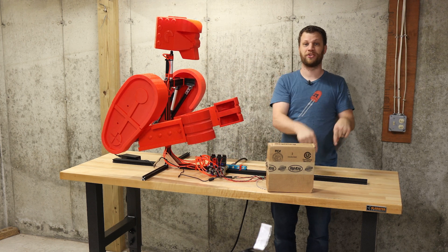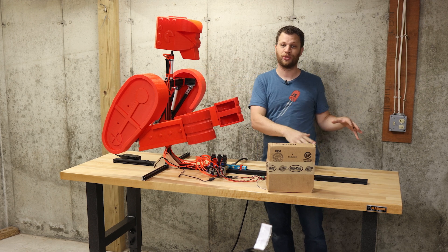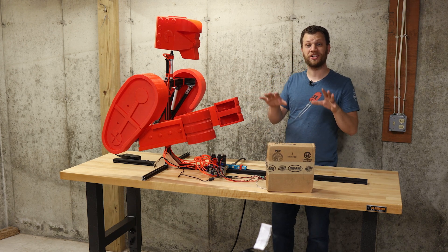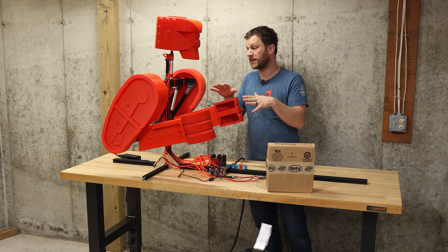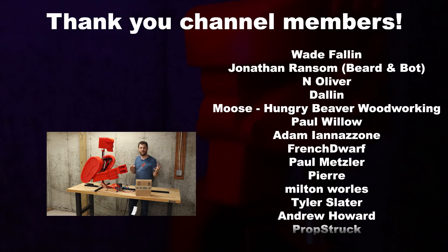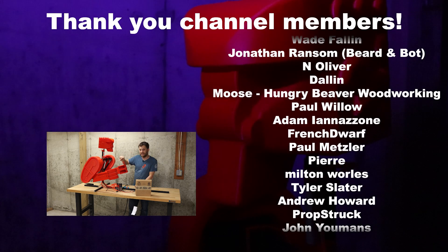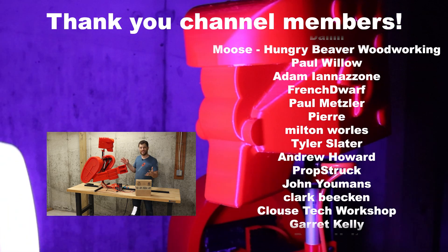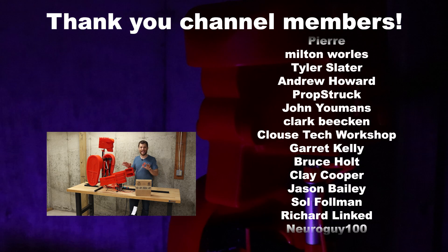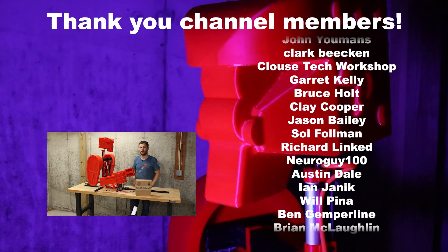I'm super excited to build the blue one. They actually have names — this one is Red Rocker, and the blue one is Blue Bomber. These are going to be super cool when they're fighting each other. There's still a ton of work to do. I have a little inertial measurement unit that will detect how hard it's being punched, and a microcontroller that will read those punches and show on a little LED display how much life is remaining in the robot. I'll be continuing to make videos about this project. Instead of asking you to like and subscribe, I'm going to ask you to watch this video right here.